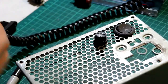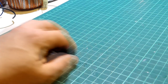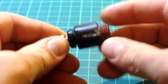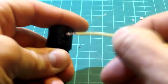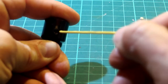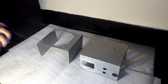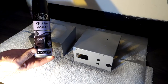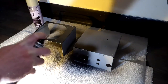Now we can make the holes for the switch and the fuse holder. For the external connector I was thinking of using a speaker connector I had, but in the end I chose spring-loaded binding post style connectors, which allow for easy connecting and disconnecting of the device hooked up to the unit. After that was done I sprayed the case with grey primer, followed by black matte paint.